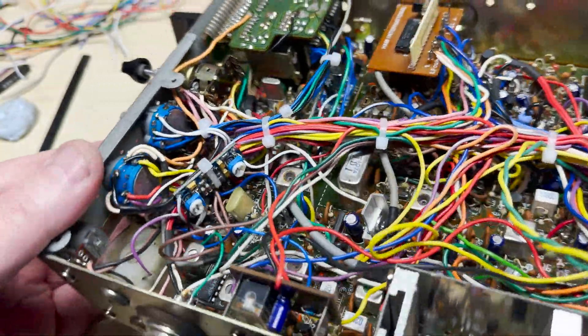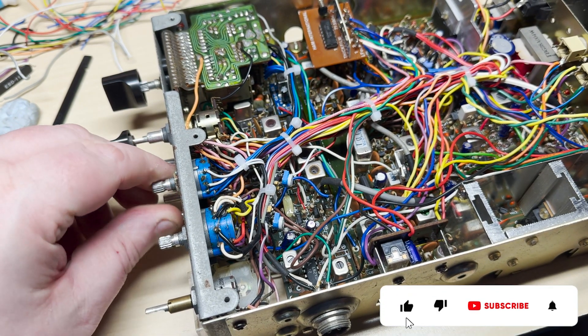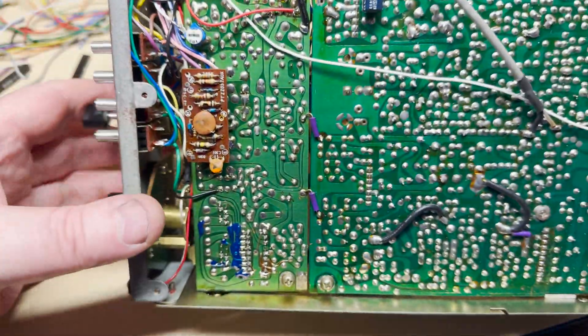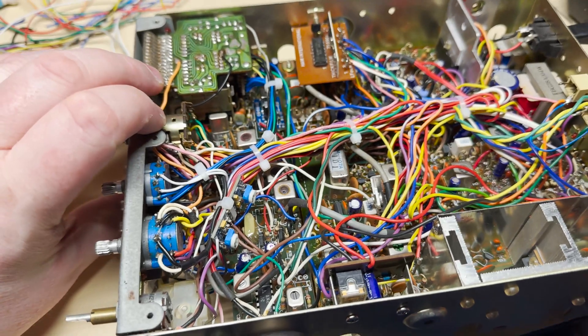Nicely cable-tied in. We've disabled the 4128 to display — well, it was actually already disabled; all it needed was just pulling down to earth. So we've got a nice five-way band switch there, and we'll put a potentiometer on the top to put us onto the UK offset.